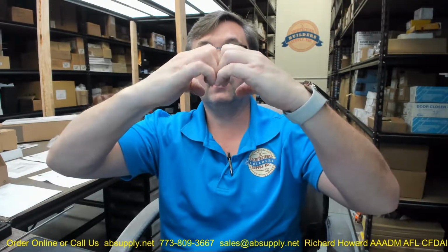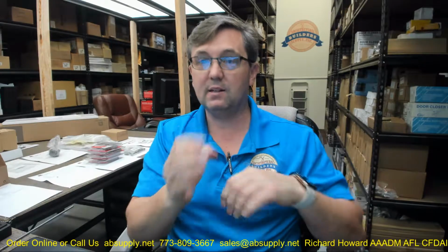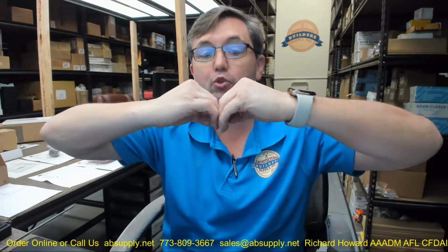The old Amweld doors were hemmed over doors like this that had that center seam. The two pans, they would take the steel and they would bend it into a big giant pan. And they'd lay that flat. Then the next sheet would come over and rest on it like this. Well, if you're going to prep into the edge of that door, you've got this huge web of steel to contend with. If it was an old Kewanee VMAX door, well, that's pretty easy, but it's thicker than what you might contend with. If you're dealing with a Seco Regent door, there's less steel on the edge of that door.